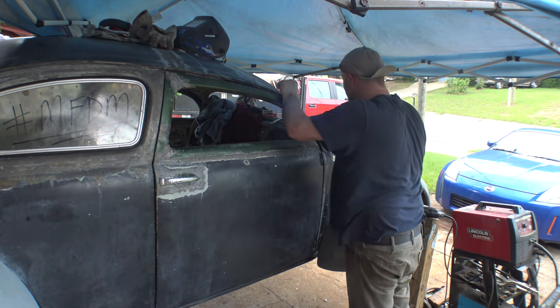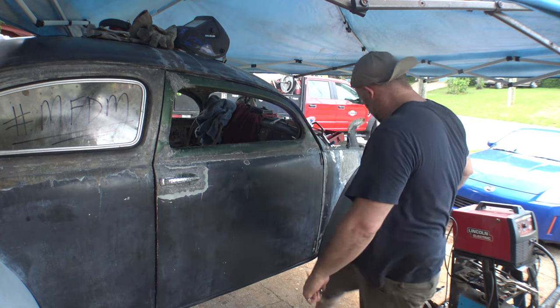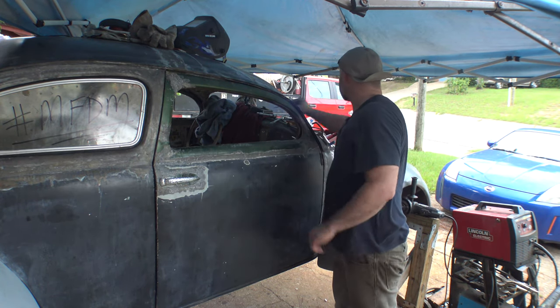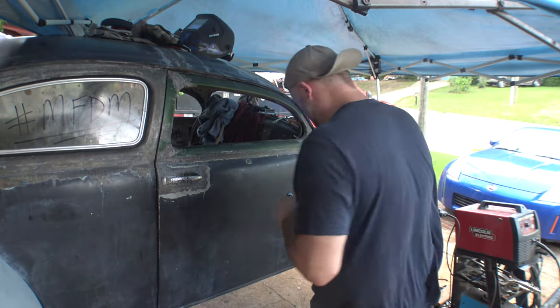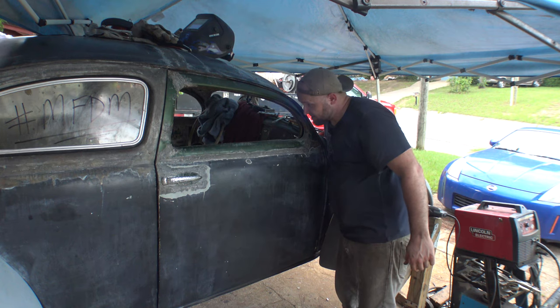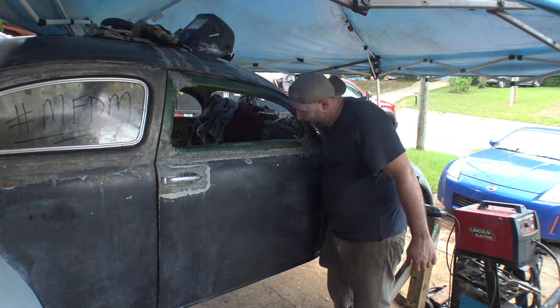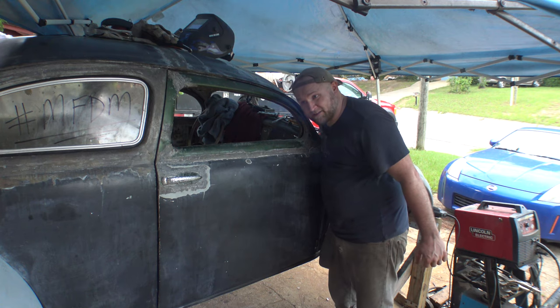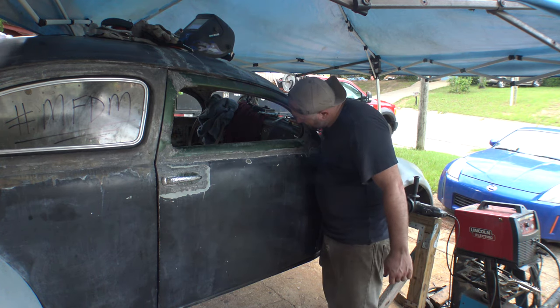Now comes the not so fun part. This is the part where you get the ratchet in there and you turn it less than an eighth of a turn because that's all the room that we've got. I don't see my ratchet over here. I had one set up with the right socket on it. I'm gonna go find it. I'll be right back. All right, I found it. This part isn't fun. I'm probably gonna wind up cutting most of it out. The top one, the hinge pin is inverted. It points up. Because of that, I have to come up from underneath, which is okay, because from the top side, I'd never be able to get the socket onto the, well, it's essentially the bolt.